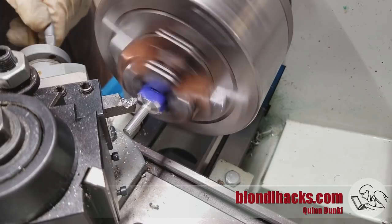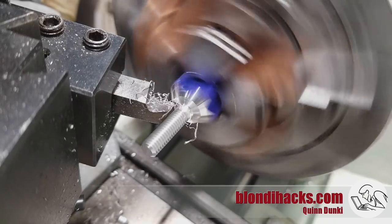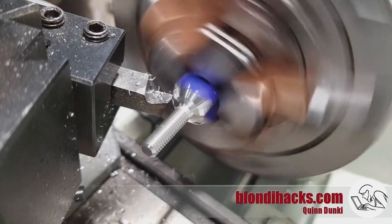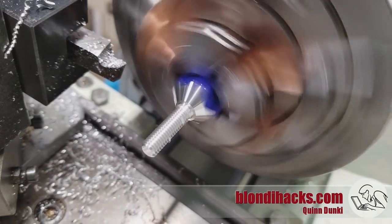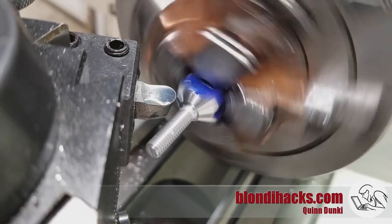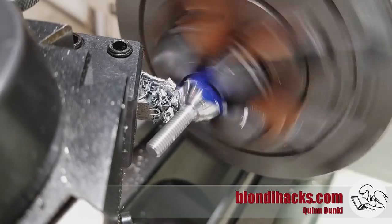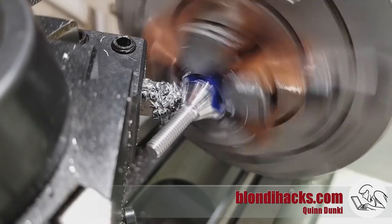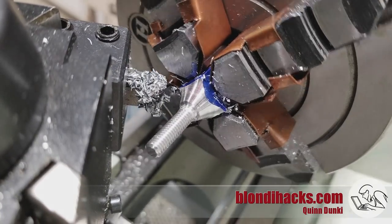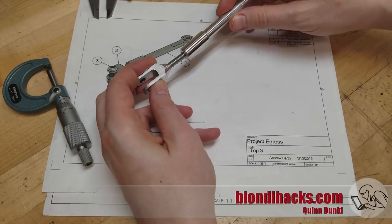There's our final fork — looking good. Back over to my improvised spindle sander to round off the corners. This doesn't need to be super precise so I didn't want to set up the rotary table all over again, so I did this part by hand and then cleaned it up on some emery paper. Now we can take it back to the lathe, set it up in the four-jaw again to cut the threads on this guy. I go in with an M6 die and cut those threads, then to get right up to that shoulder I flip the die over and do another pass. Finally, I want to shape the underside of this clevis to give it a more svelte appearance. I started by tapering it using the compound, rearranging the tool post a couple of times to get different angles. Then I came back in with a round-nosed form tool for a concave profile — I just free-handed this with the hand wheels until I had a shape that was satisfying, battling chatter with a round-nose zero-rake tool in aluminum, but the final result is pleasing enough.